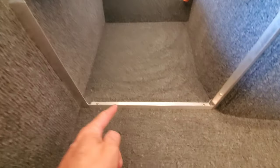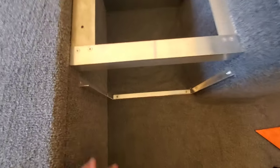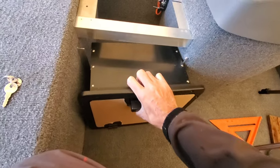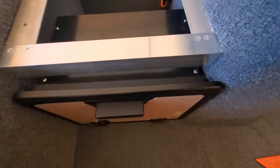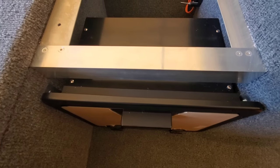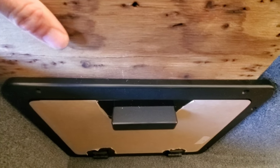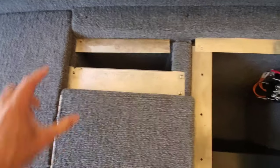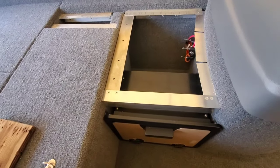Don't discriminate — one-inch by one-inch, three-quarter by three-quarter, three-quarter by half-inch on the side. Whatever works. I went ahead and connected the dots on the top and left a gap — I'll show you in a second what that's for. This unit goes in and it is a tight fit — locks right into place. Super nice fitment, and that's going to give me something to screw into around the perimeter. Up top, I left this open because my plywood is going to run wild and I'm going to have another piece of plywood on the underside to tie in. Right now what I need to do is make a template of this — it's an odd shape, gets wider as it goes back, and there's curvature up against the steering console. So I'm just going to template it out and take my time.